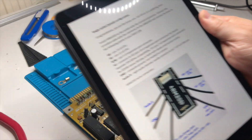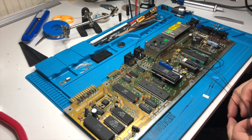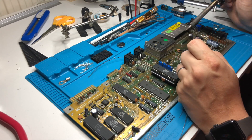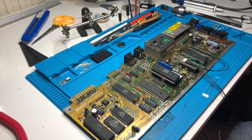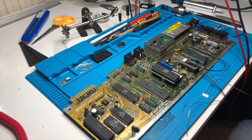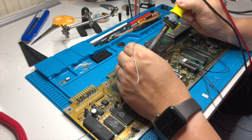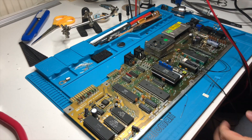We'll wire up the cable needed to get all the address lines into the ARM2SID. Some of them come from the CPU, some from the cartridge port. The manual is very nice and detailed. There's also a wire that goes to the audio-video port in the back — I'm going to use pin 7 for the second sound channel, as it's unused so we don't risk frying anything.